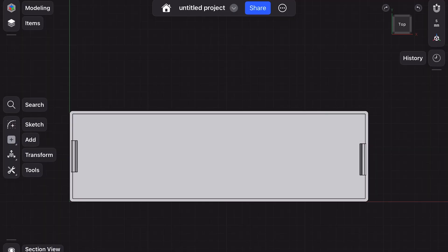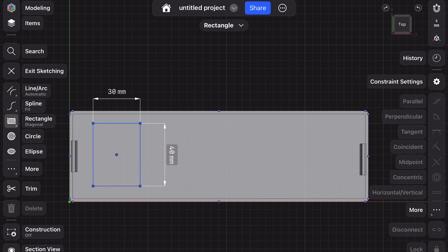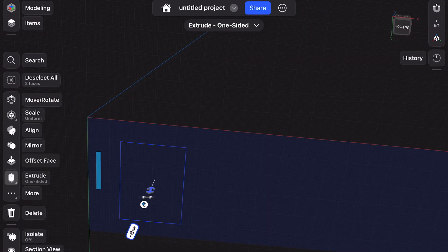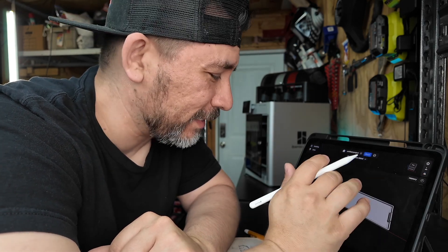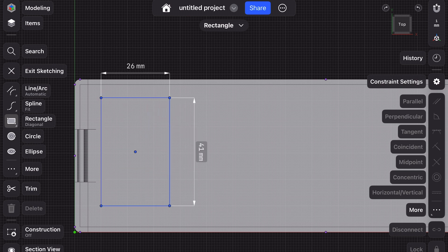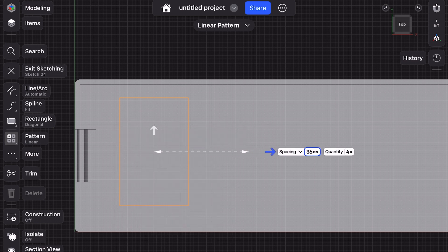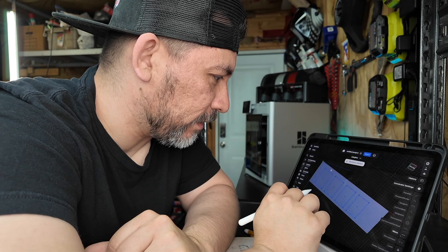What we want to do is add a couple of switches into this. You can create a rectangular shape again — let's go with something simple, maybe 30. Once you do that, rotate around and use our tool to punch a hole. Now, what if you want to do a bunch of different switches that are all the same size? Go back into our sketch, create your shape, maybe move it to the appropriate place, and use the pattern tool again. Change the quantity to four. Now you can see multiple shapes for all your different switches.